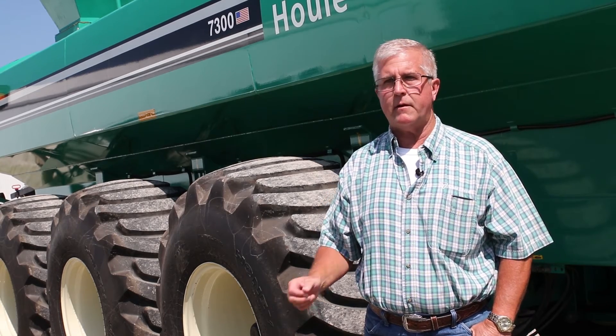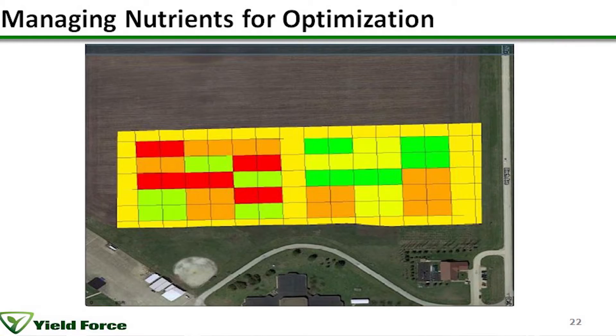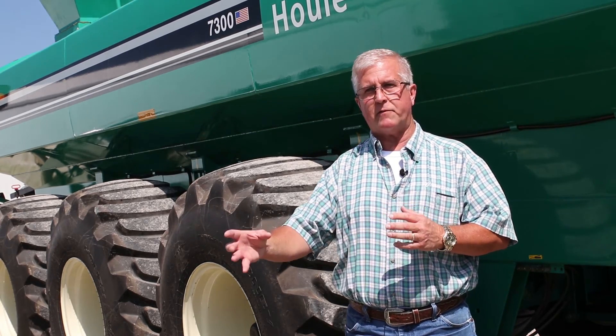This spring, using the Harvest Lab and the manure constituent sensing applied with a drag line, it's very clearly defined — those ranges I mentioned regarding variability are almost exactly shown in these maps. It's very obvious where they laid the drag line out and applied on one side, then came back and jumped to the other side, showing how things are changing and how critical it's going to be to correct for the variability in the application.